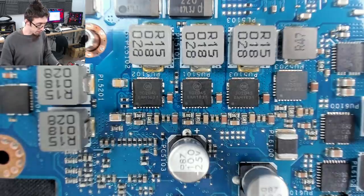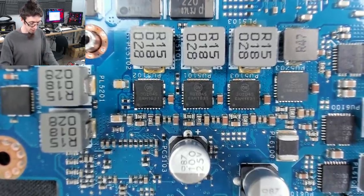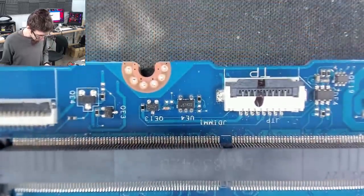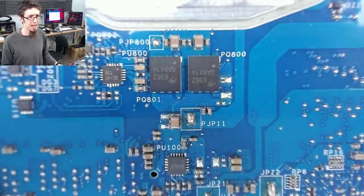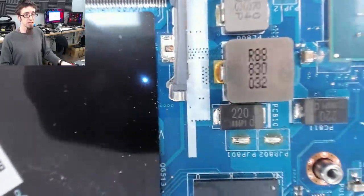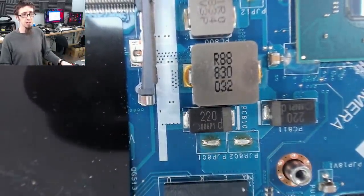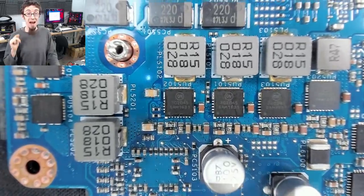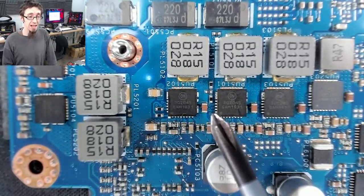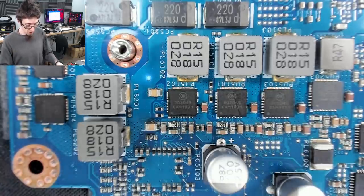The other thing that we've often seen in laptops that I've often showed off, have we got one in here somewhere? Where's memory V-core? Yes, memory V-core is over here. So for the memory power here, we've got a pair of MOSFETs. And on the other side of the board, there is an inductor for those MOSFETs. So that is the normal regulators that I've shown off before. These guys are discrete power stages. So they are super exotic. They can do a lot more power handling than just a pair of MOSFETs can, which is why we've got fancy power stages down here.